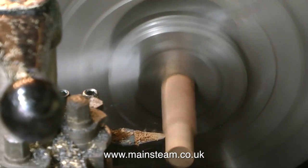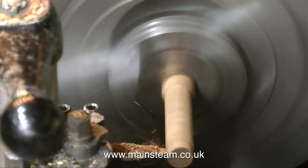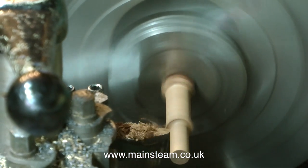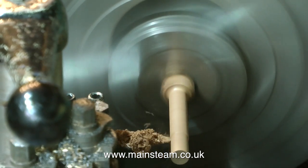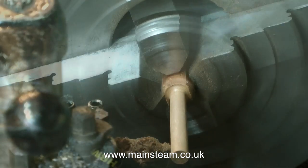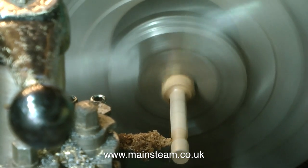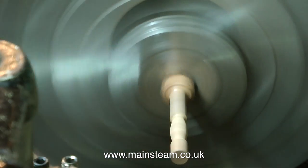I cut a piece of this excellent hardwood using my bandsaw, then fitted the almost-square piece into the four-jaw self-centering chuck in the larger of my two lathes. With the help of a micrometer and the original piece of wood, I turned this piece to the same diameter. To make this component it's just a case of turning the handles at the correct ratio. I really should have put a centre in it and supported it, but it works fine — and it doesn't really matter if they're not exactly the same, since even the original commercial stanchions aren't all identical.